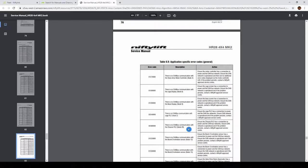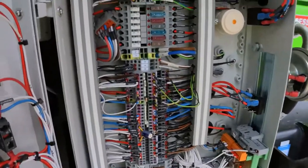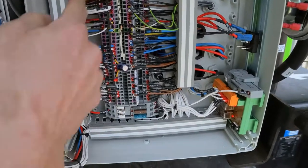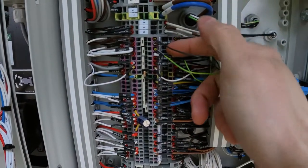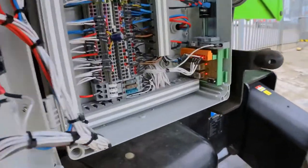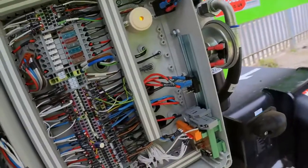I think what I may do is a resistance test just to confirm the connection and termination on both ends. I've opened the main box - right here I have the CAN high and CAN low wires. CAN high is on the two top terminals, number 11 and 12, and CAN low wires are terminals 13 and 14. I'll switch the machine off completely.